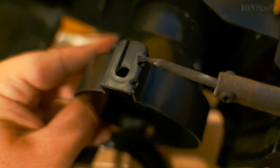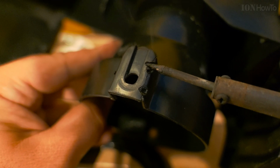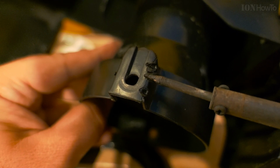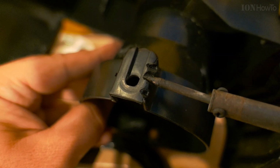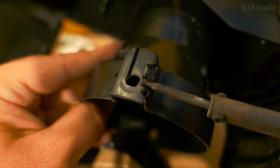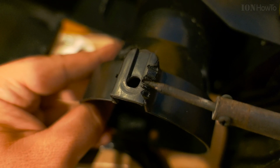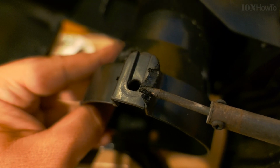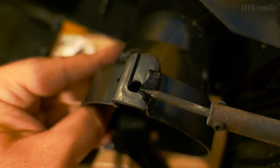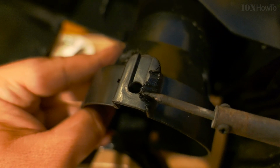And you see, I promised you a better angle. This is the better angle. Now this is very important here. Look closely. I put the soldering iron down and then fold it over left and right. And then a little bit to the left, down, and fold it over left and right. And then move more to the left again, down, and then fold it over left and right. The reason I do this is to really fuse the layers of plastic inside. If I wouldn't do this, it would be a superficial bond, and I want it to be strong, so that's why I'm doing this. You see, I press it down.